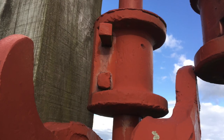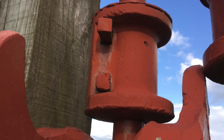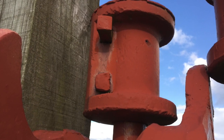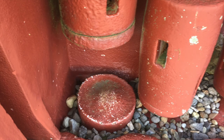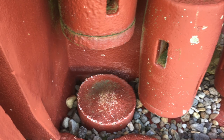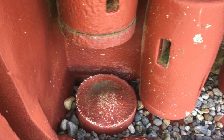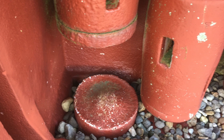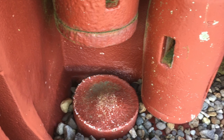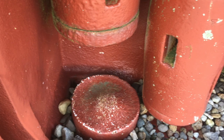In this example of a cam follower or tappet, there are tapered wedges hammered in from the side; they press a metal plate called a gib against the stem to hold it in place. Often the tips of the cams were cut at an angle to match the curvature of the tappet as it fell off the end. The shoes and anvils are very well worn, but interestingly they are worn evenly due to the rotation. The mushroom shape seen in the centre is likely related to the fact that the grinding motion is more effective around the edges of the circle than in the middle, or possibly related to the flow of pulp or slurry bringing material more around the edges after each impact.